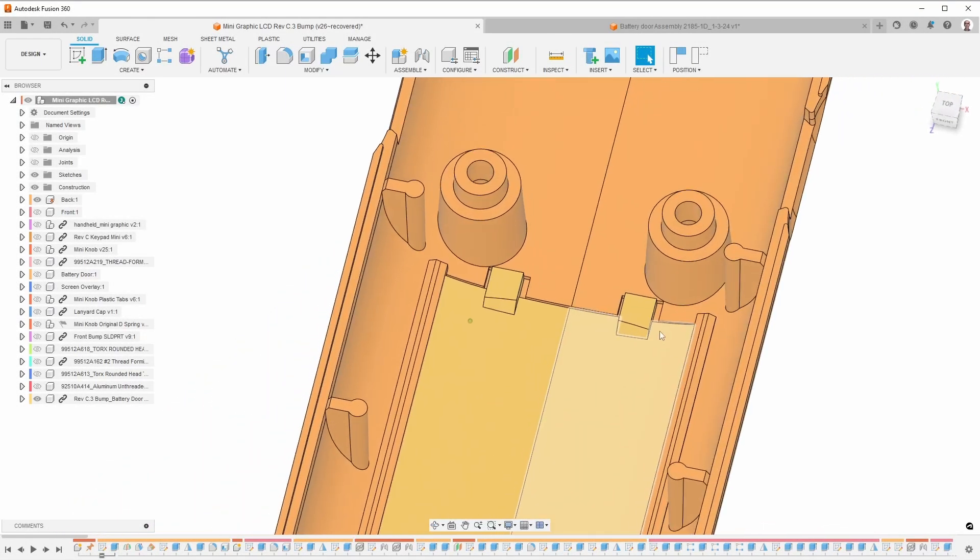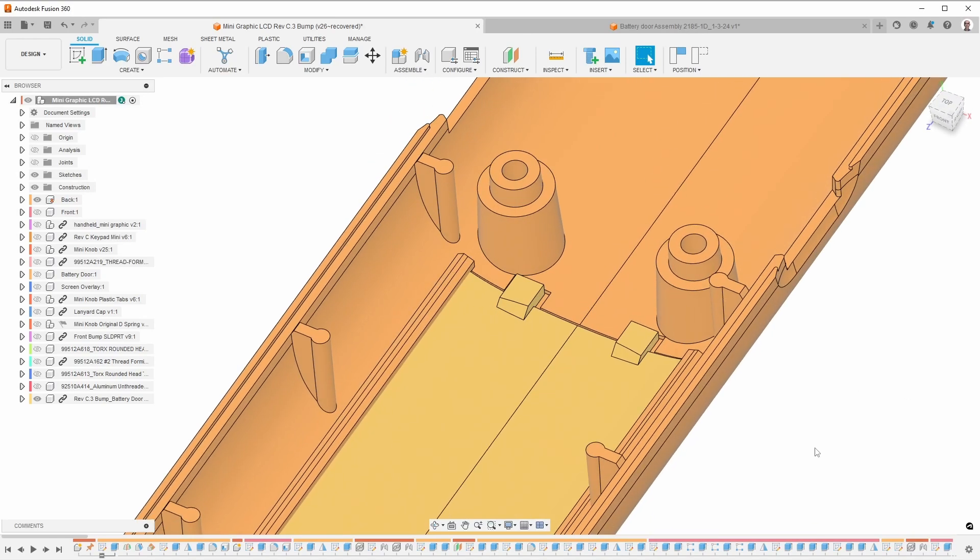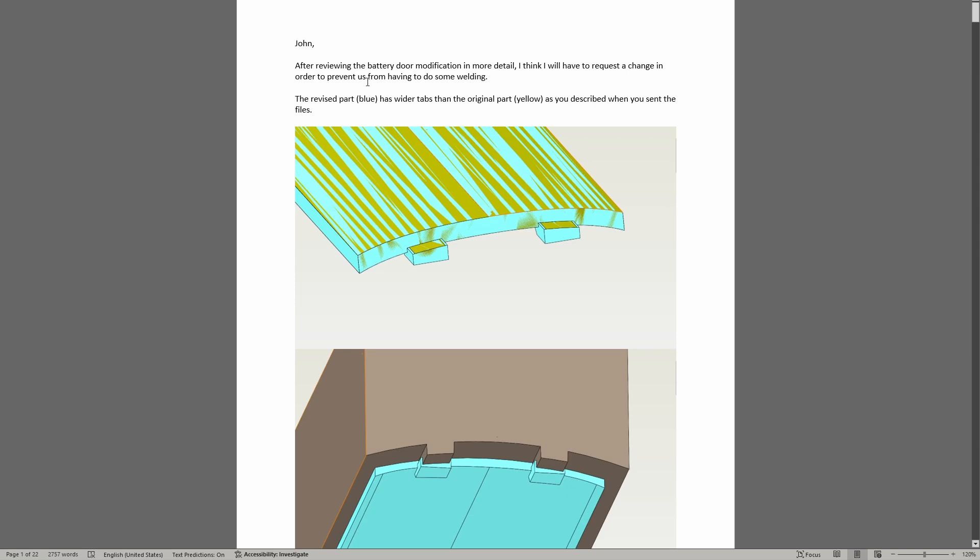In the last episode I mentioned that I could make these tabs wider because it was steel safe. This is the reply we got from Texlan Plastics — the important part is right here. They said they had to do some welding to be able to make the tabs a little bit wider. This picture shows the before and after — you can see the little lines there. I'll show you the actual CAD files they sent me to give you a better idea of what's going on.